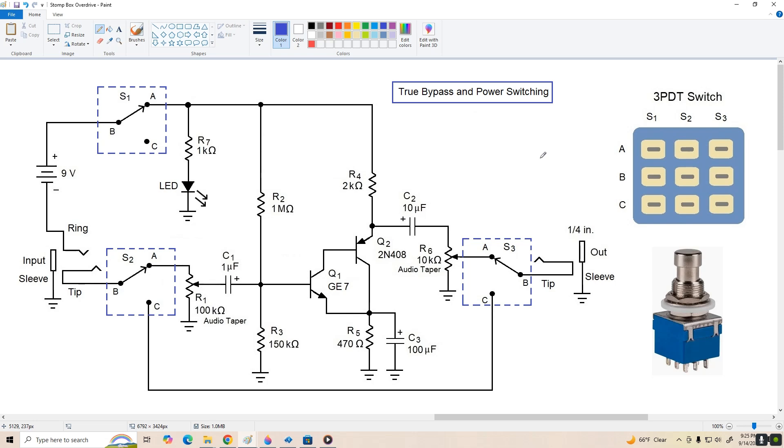Let's talk about battery life. Whenever we're using the effect, we're drawing about 2 milliamps to bias up our amplifier, and the LED is probably going to draw maybe 6 to 8 milliamps. So on average, we're drawing maybe 10 milliamps from the battery. A typical 9-volt alkaline battery has a capacity of about 500 milliamp hours, so if we're drawing roughly 10 milliamps, we should get about a 50-hour life from the typical alkaline battery. We still might want to add an external power jack so we could run this from an external power supply.